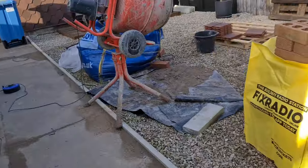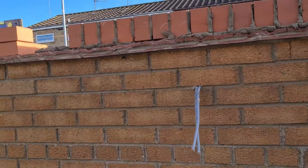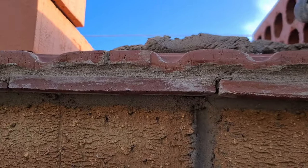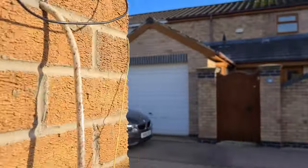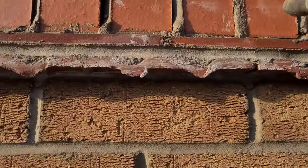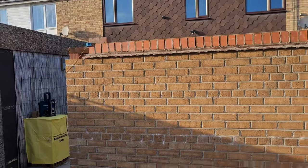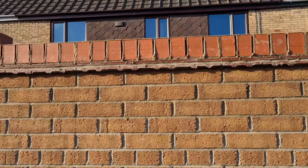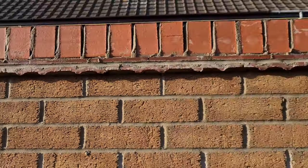If I look on the other side, I've left all the rags on and everything, and if that starts to dry out I can use that to joint up with. All these engineering bricks are all different sizes as well, so when you're doing anything out of one brick, you can only ever straighten or plumb one side. Because by definition, if you knock the brick one way, it's going to come out of alignment with the other side — this is the decorative side. So we've got a Class B engineering on the top, and basically a rosemary tile that acts as a DPC — water runs off.